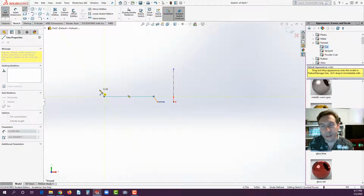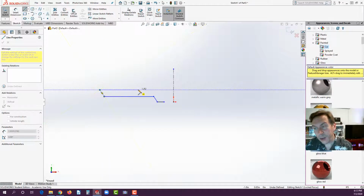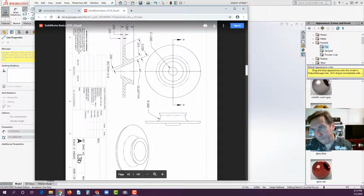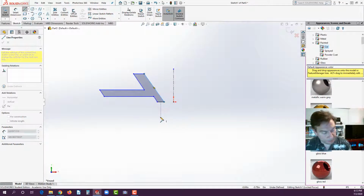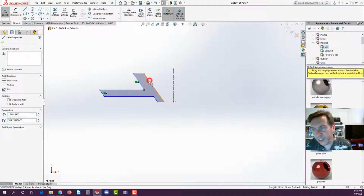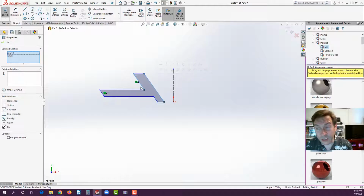And look at this, you could find the angles. Look at that little symbol to the right. It's actually aligning parallel to the other angle. You can see because the other angle is actually highlighted. That's an automatic relationship of parallelism. That's what you want here. Click, drag this across, and let's take a quick look at that again. Okay, go in like so. Again, parallelism. And sadly, I missed the marker a little bit, so I'm going to just connect there. And I'm going to Control select these 2 lines after I hit Escape. Then Control select those 2 lines and make those parallel.